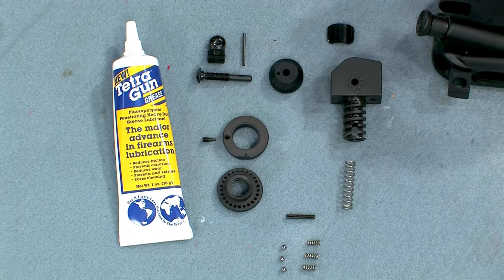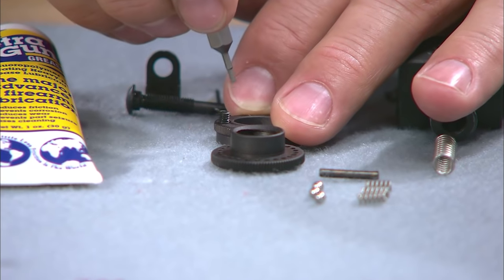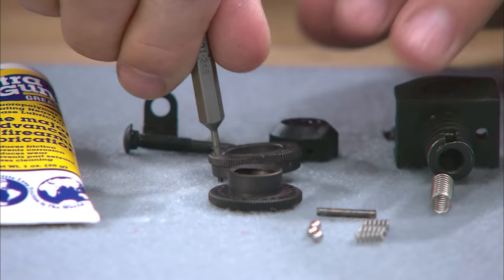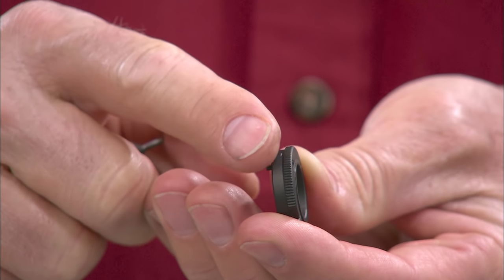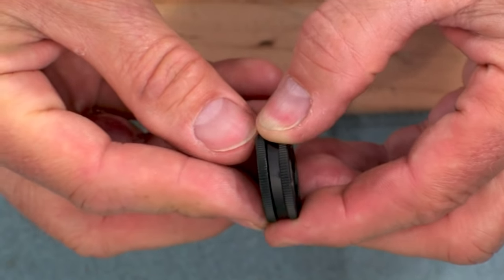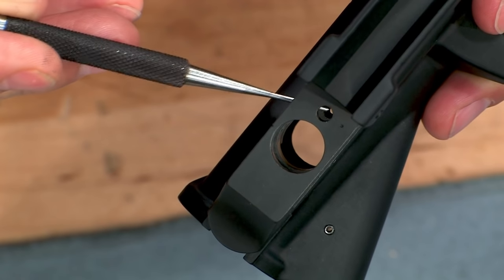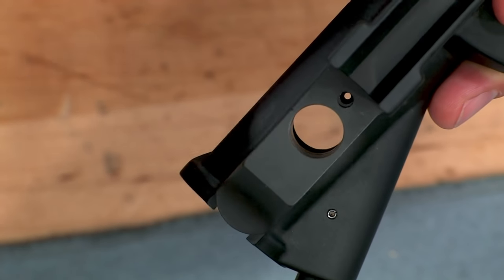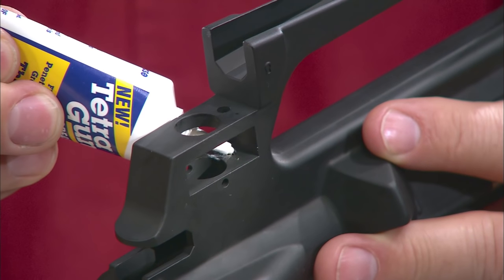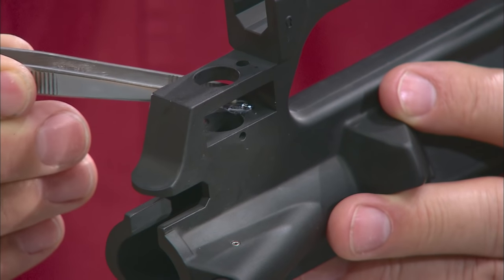Before you begin it's a smart play to lay out all of the parts so they're easily accessible. Start by screwing the rear sight base index screw into the rear sight elevation index wheel with the 1/16 hex wrench. This screw should be flush with the outside of the index wheel. Now combine the index wheel with the elevation knob. The index screw can rest in any hole in the elevation knob. A detent ball located here places tension on the elevation knob holding the elevation adjustment in position. Put a dollop of grease in the detent hole and install the spring and detent ball.